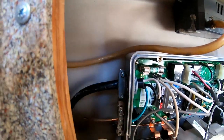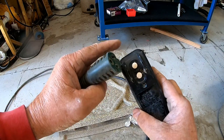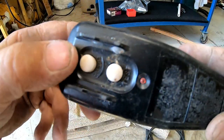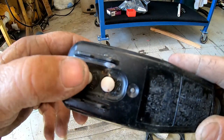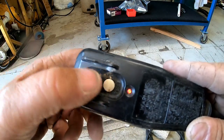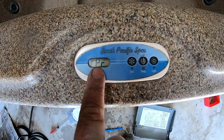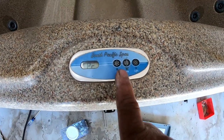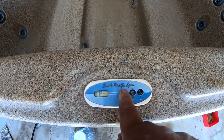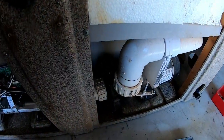You've got your ground, your white wire, your black wire — pretty simple. Make sure these are tight and we're done. I've got an extension cord and the GFCI plug I just wired in. I'll go ahead and plug it in — the red light came on, that shuts it off, that turns it on. You can tell it's working because the red light came on. The display says 'PR' which normally means prime. Let's hit the jets — I can hear the electric motor running on second speed, so that tells me everything works.